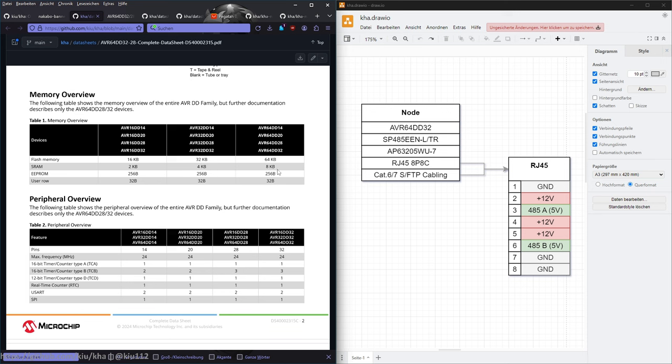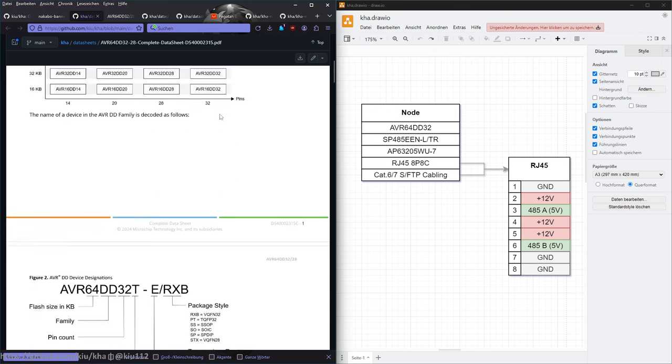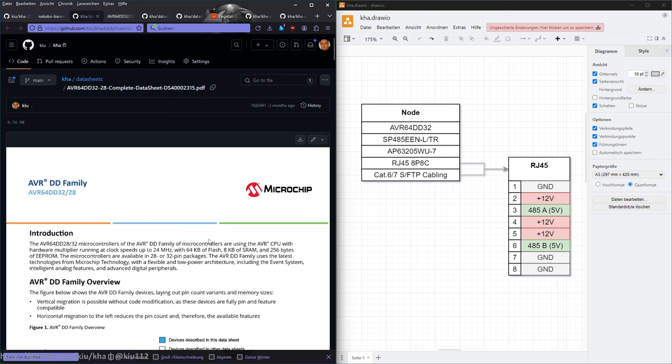There are 8 kilobytes of RAM, which is great because I'll be handling and buffering multiple messages. It runs at 24 MHz, which is quick enough to drive some LED strips. It has two serial ports and an SPI port, so I can have one for the internal RS-485 serial bus and another for driving other components. Overall this device suits my needs.